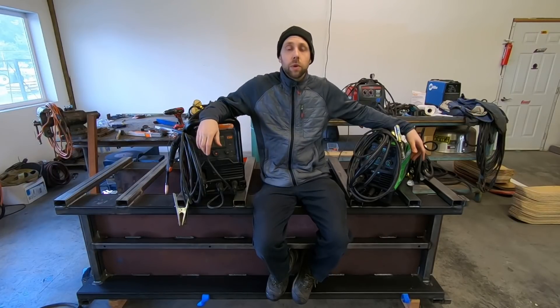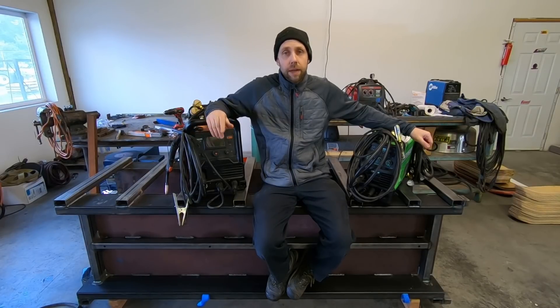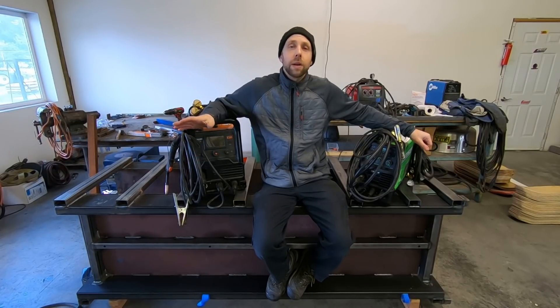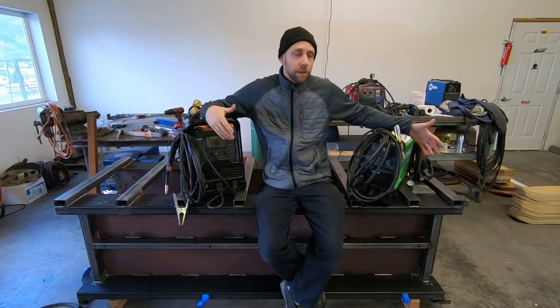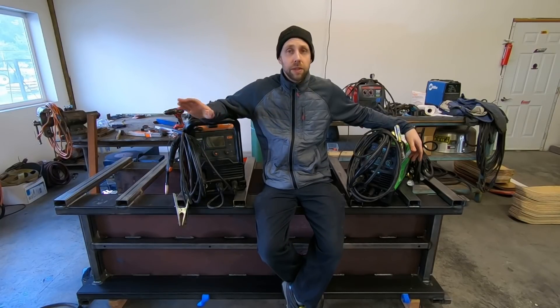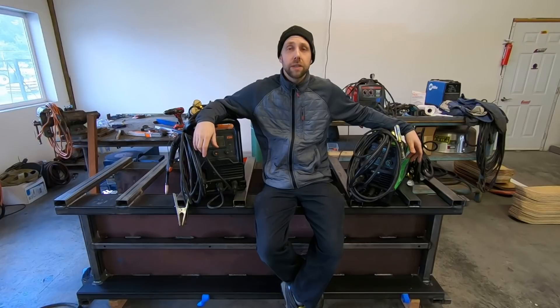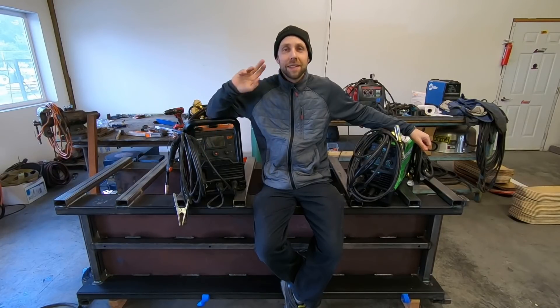I know some of you guys don't have 220 volts. I'm gonna do one more MIG video after this of 120-volt duty cycle tests and what kind of metals you can expect to weld on MIG — for some of you guys that don't have 220 in your shop. If you do have 220, I recommend using it — it puts less stress on the machines and you can weld thicker metals. On 110, you're going to be limited to probably eighth inch or so. After that, I have some interest in stick and TIG for the multifunctions on here, so I'll be doing a few review videos on that as well. If you guys are interested, subscribe and hit like. See you guys, bye.